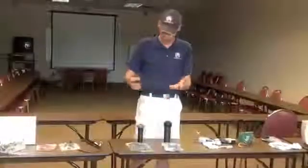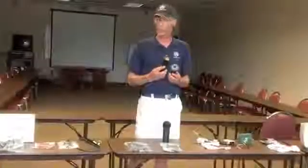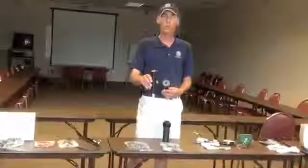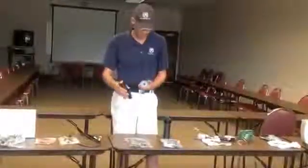This product, for example, is a SAM PRS from Rainbird. This is one from Hunter. They're both really the same product — they both regulate pressure, and they both have a check valve. So if they're on the low end of a hill, the water won't continue to run out after the system, thereby being available for the next watering event.